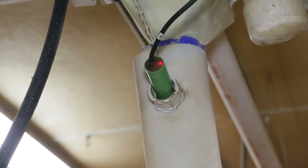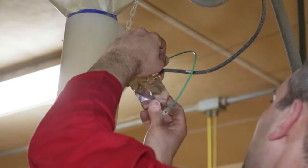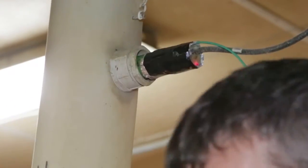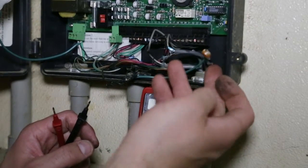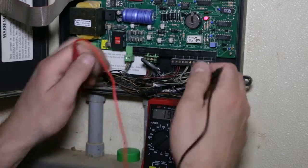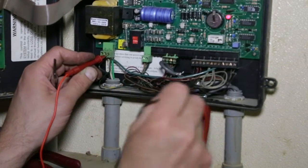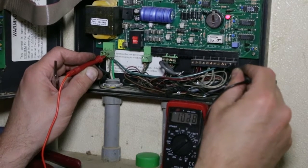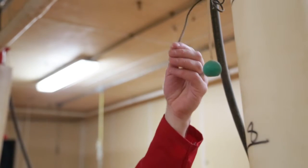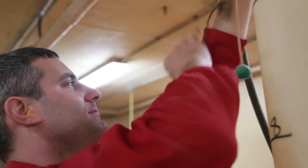Cover feed sensors with a Faraday cage — durable foil tape works well. Add a wire to the earth ground and wrap the foil with electrical tape. If you are unsure that a sensor or piece of equipment has been grounded, as a precaution, disconnect the sensor wires from the computer, but not from the earth ground, prior to plugging in the EPI system. Measure the static charge on the sensor wires before and after plugging in the EPI system. The measured voltage should be the same if properly grounded. If okay, reconnect sensor wires and test sensors. After grounding all sensors, connecting and grounding the automation wire while the power supply is plugged in, make sure the sensors work and that no static charge is building up on the sensor wires or tip.